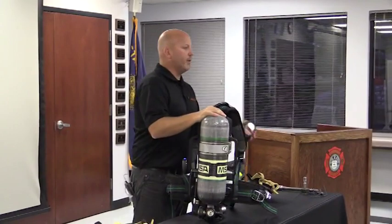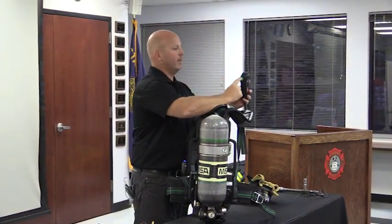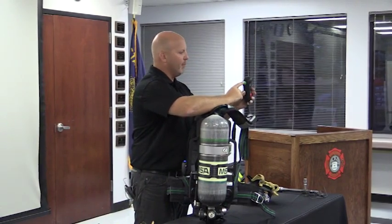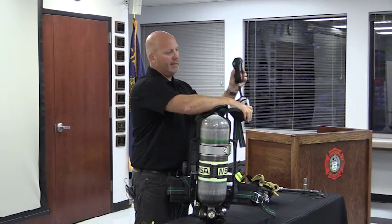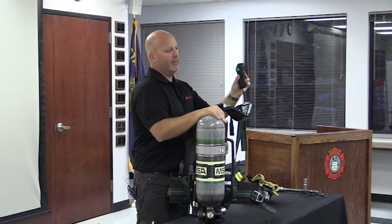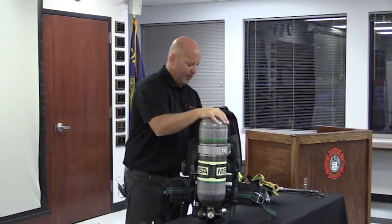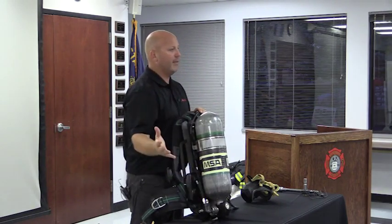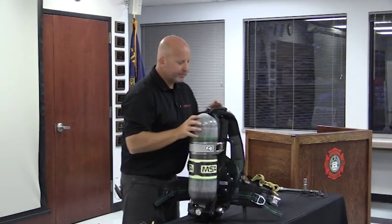Now, no air pressure in the system. I can push twice on either one of the green buttons. Either side makes no difference. It's not one on one side, one on the other. It's double pushing on either side. Note what'll happen: I'll get the international off symbol. It'll de-illuminate and everything shuts off all at once. My control module, my PASS device is off. My amplifier is off. My lights on my back are off. Everything's back to sleep. Make sense?